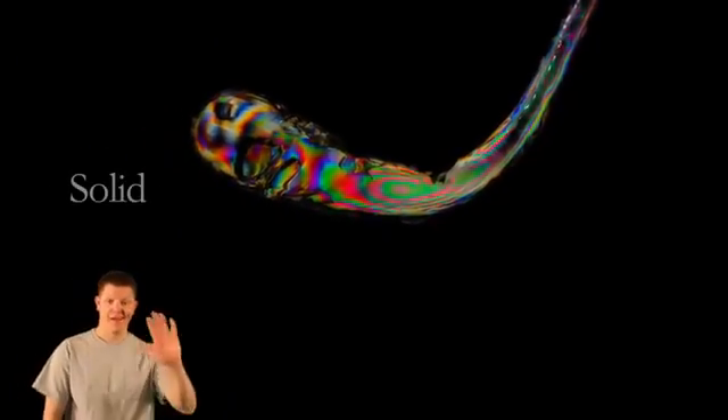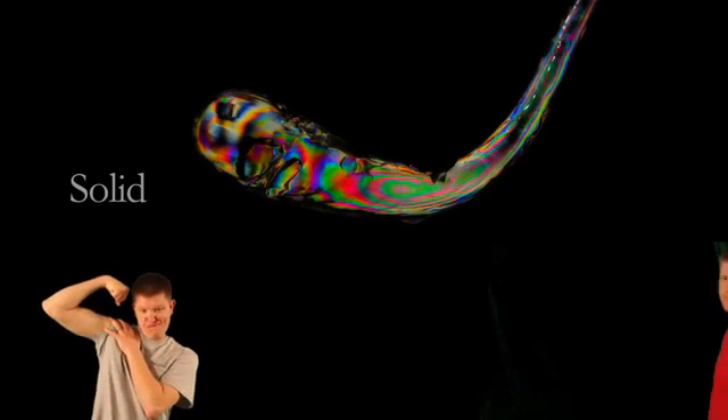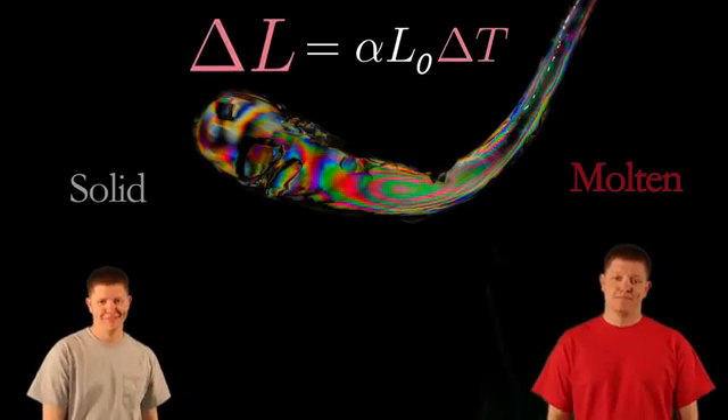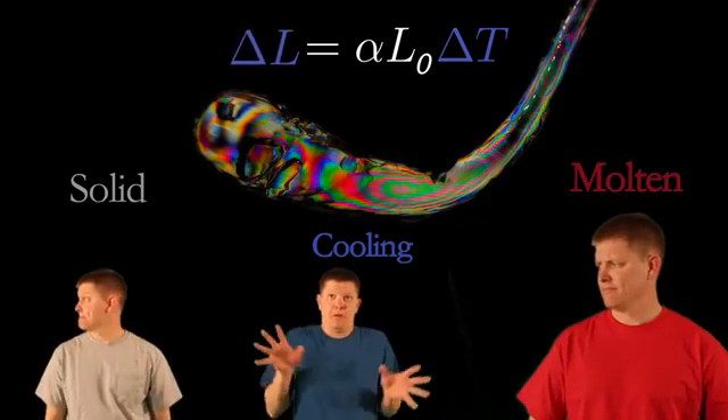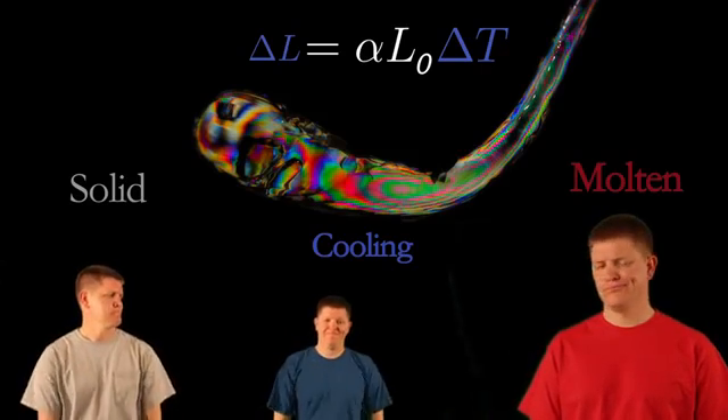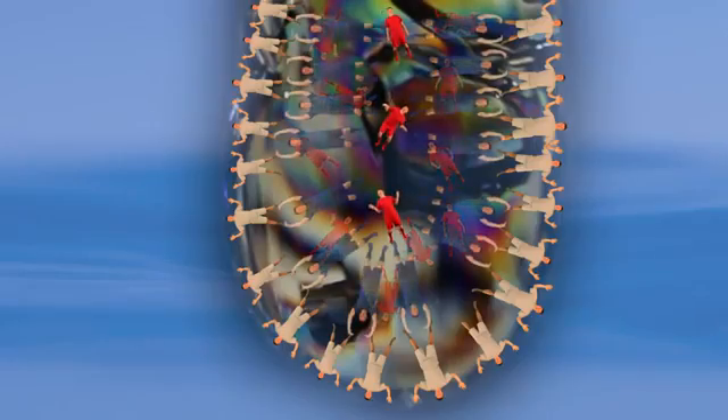To understand how these stresses got here, let's use the color gray to represent nice and strong solid glass. We'll use red to represent molten glass — because of the thermal expansion coefficient, the higher the temperature, the larger this glass wants to be. Blue represents glass that's cooling off or transitioning between the two states; because of that same thermal expansion coefficient, this glass is shrinking and pulling in on itself. Think of a Prince Rupert's drop as a bunch of little infinitesimal pieces of glass, each trying to interact with the pieces around it. When the molten glass is first dripped into the water, the outside layer touches the water and immediately solidifies, locking in that outside shape of the drop. The inside, however, is still a hot expanded liquid. As heat is transferred to the water, the glass on the inside slowly begins to cool down and pulls in against that outside layer. The problem is that because it's already locked in as a round solid, it only compresses tighter against itself. This actually makes it stronger — kind of like how an arch compresses and gets stronger when you put your weight on it, only this is in all directions.